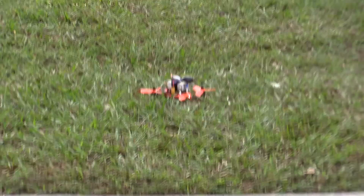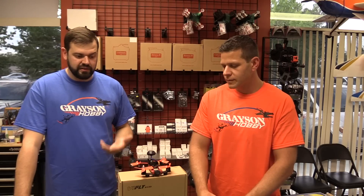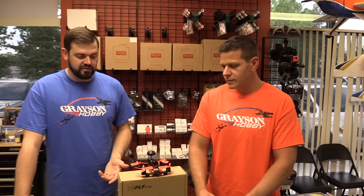There's a chance you could burn out an ESC on this thing. Conformal coating is an electrical protective coating that prevents water damage. Hopefully the manufacturer will change that and start coating them, because I think that's going to be a huge bump in reliability — it's already a very well-made quad. This seems like just a minor oversight.